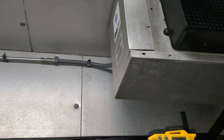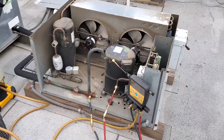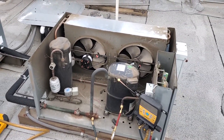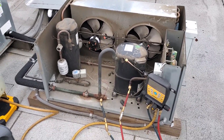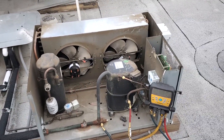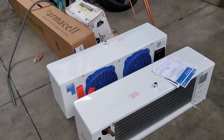It is slowly coming down to temp in here — 42 degrees. It's going to be a little while, but it's getting there. We are back and we're recovering the refrigerant from the old unit and we're going to go ahead and replace this equipment. The recovery machine's running. We're going to let it go and start taking everything apart. Two new coils and we've got a condensing unit ready to be lifted on the roof.